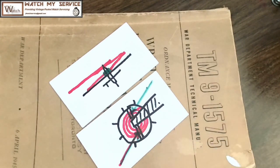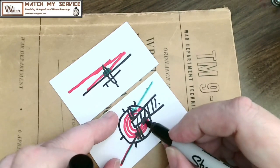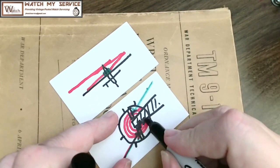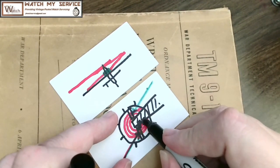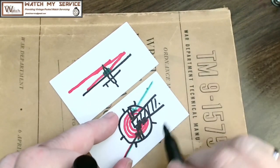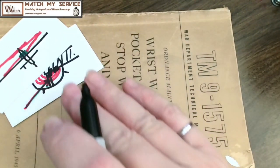The hairspring was studded on the balance cock or the balance bridge, and as the hairspring came around, there were regulator pins coming out like this. And when I studded it back on to this here, because normally you just screw it in to the balance bridge, this actually had a stud, and it was in that fake Swiss watch I was repairing. And so when I put the very small piece of brass pin and I pinned it back in, this was pinned at an angle. Can I explain that with yet another diagram here?